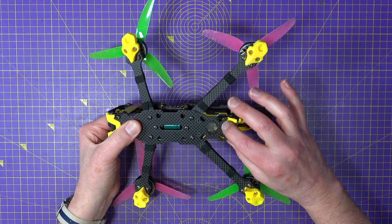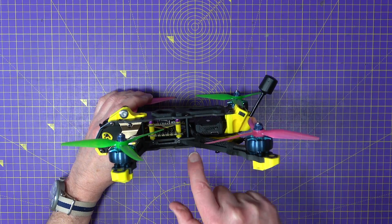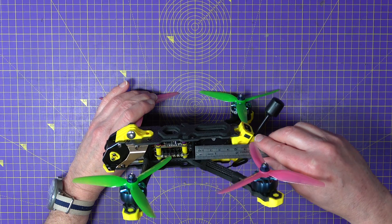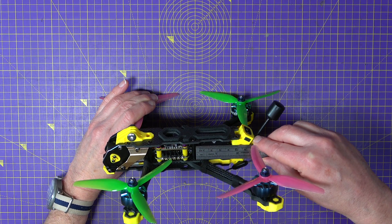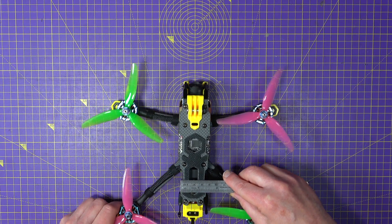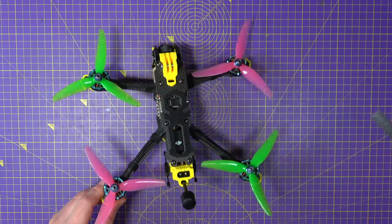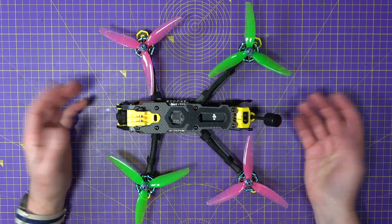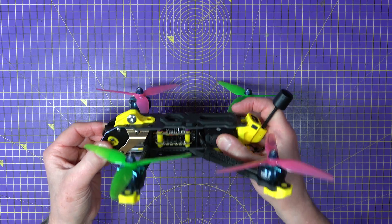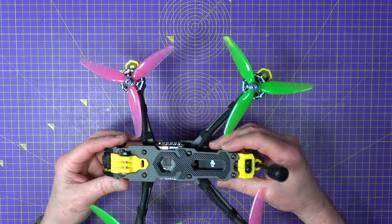well, you can't see it — there are four screws and you can reach those through the holes in the bottom frame. I had a couple of questions about what other VTXs could fit in here and somebody asked specifically what size. So measuring this, the space is about 40–43mm long, about 35mm wide, and about 23mm deep. So there's plenty of room to fit whatever VTX you want — walksnail, O3, the original DJI air unit, and pretty much any analog VTX.